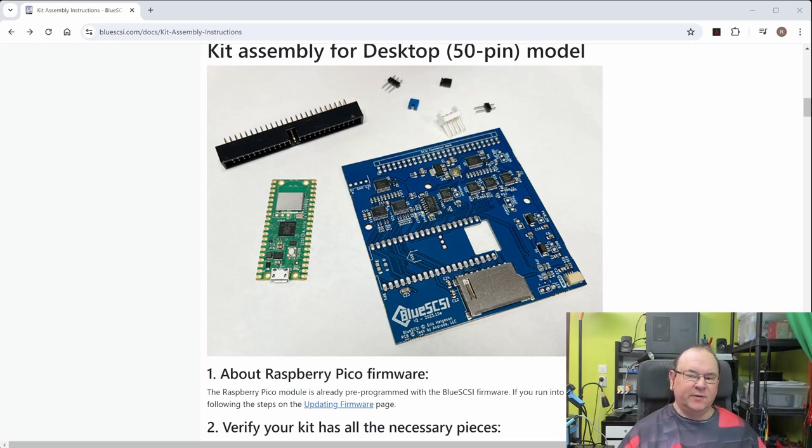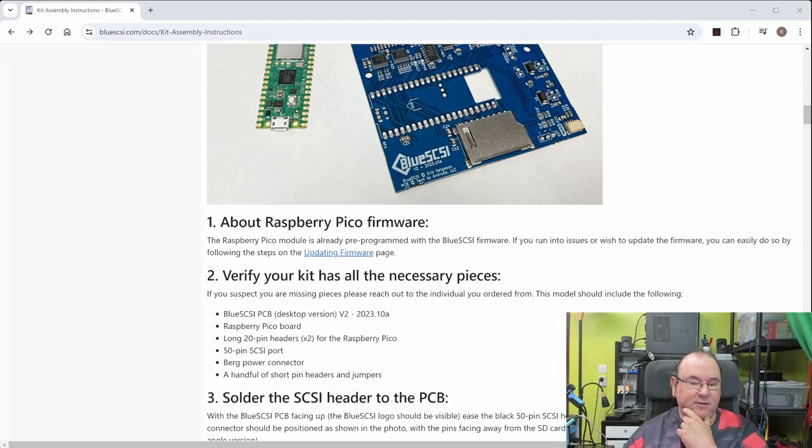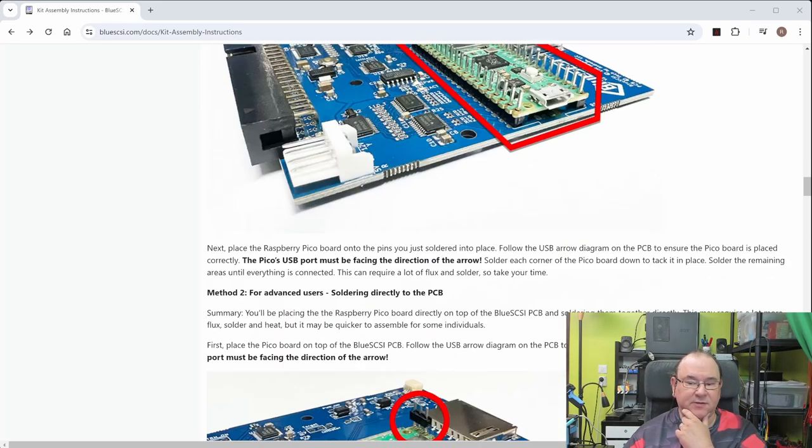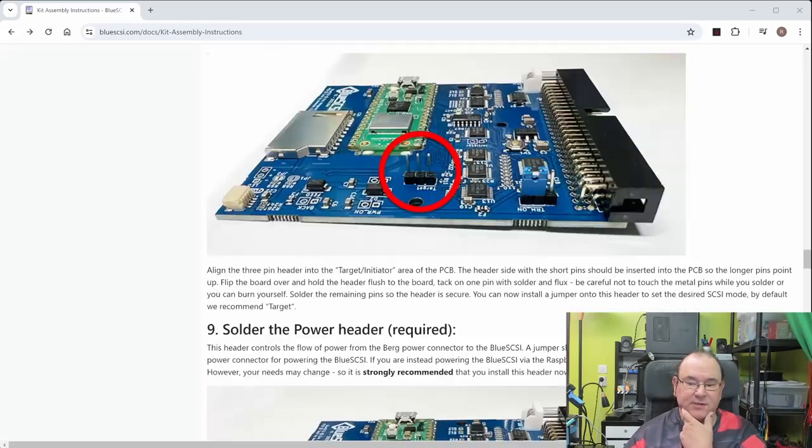This actually makes making electronics with boards with SMDs not that unrealistic even for a hobbyist like myself, who hasn't got all the equipment. I could design this board, and then get the board manufacturer to buy the simple SMDs, passive components, capacitors and resistors, and pre-assemble the board. Then the only things I would need to add are the connectors and some more larger components. In this case it supports Raspberry Pi code, and it has very good assembly instructions here. It shows you how it's put together and different assembly options.